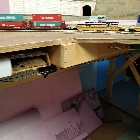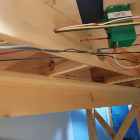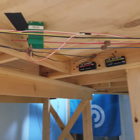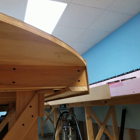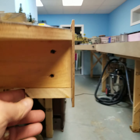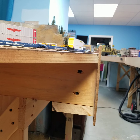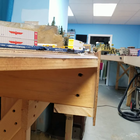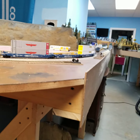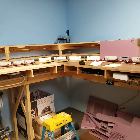I'm going to do the same — one-by-fours on the flat — and run it out. This is an L-girder layout, by the way. The reason I need to do the one-by-four is to match that end. What I did, as you can see, is I have the one-by-four under the L-girder and the top, which gives you a little bit wider of a fascia.